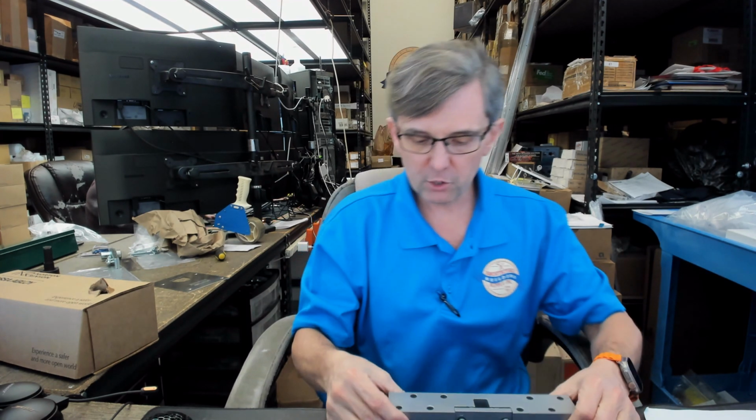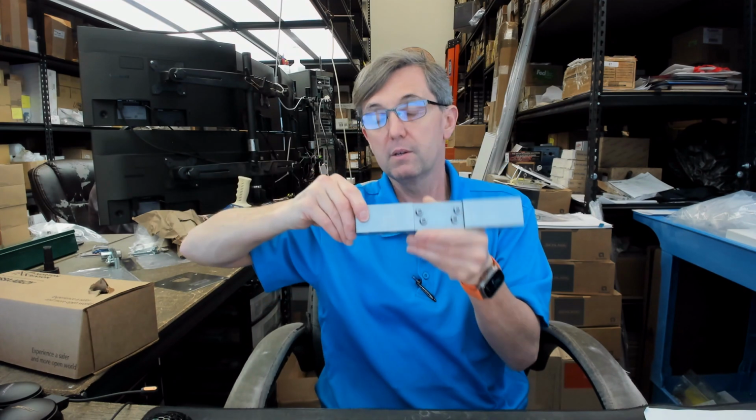When the door is at 90 degrees, so your jamb in this case is here, let's say if it's here, and this is the doorway, you can then get up to the underside of the header, and through that walking beam pivot, drop that pin down and secure the door in place. It would never work with an end load, because you would literally need to be able to take the door and tip it in place this way, assuming that was even possible. Is it possible?